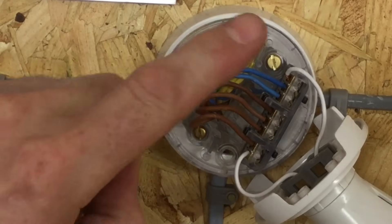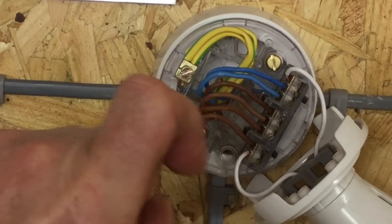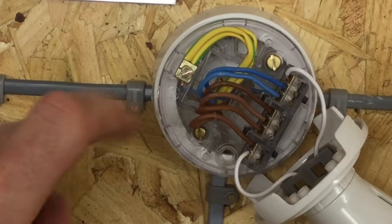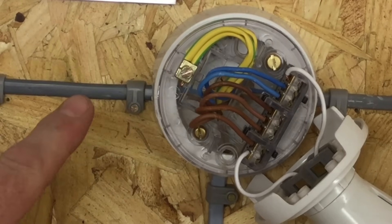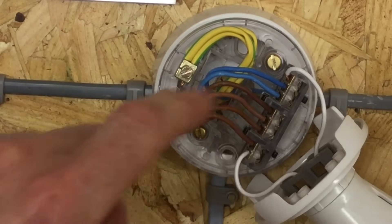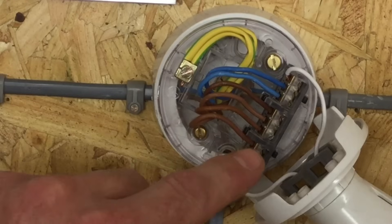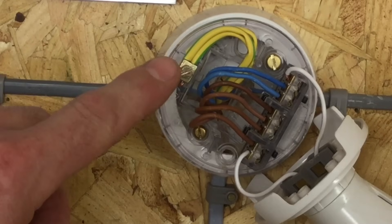For the lamp to work, the other side must have a neutral connection, which comes in from the supply cable. The neutral goes into the neutral block — also a block of three — which is connected to the side of the lamp. The CPC is terminated into the earth terminal for protection. So in summary: the supply cable brings in permanent line, neutral, and CPC. The line goes into the loop terminal. We bring twin brown down to the switch — permanent line going down, switching line returning to turn on the lamp. The lamp needs neutral on the opposite side, and protection via CPC.